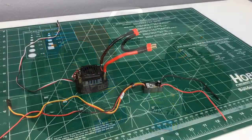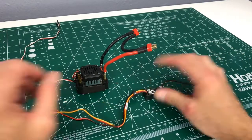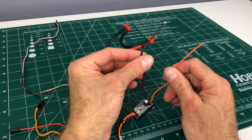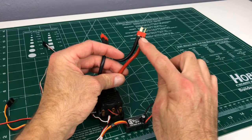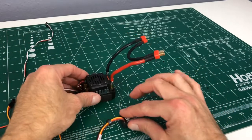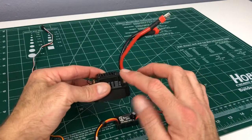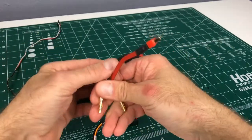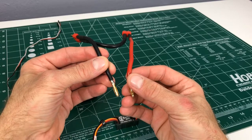So how do you put one in? I've got these parts laid out before I get to the soldering. The BEC needs to be connected directly to the battery — it has positive and negative leads going straight to it. One of my other kits is a 2S kit and I just soldered them direct to the Dean's plug, red to red, black to black, and put new heat shrink on it. Because this kit is a 4S kit and this BEC will take up to 60 volts, I'm going to solder it directly to the leads here — I've already pulled the heat shrink off — and then put new heat shrink back on top.